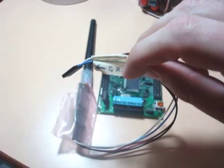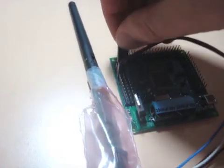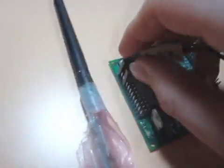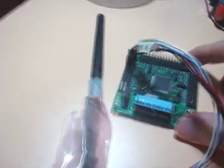Now there's also transmit and receive. I've already labeled these wires, so I'm going to plug them into UART0 right here. So now Bluetooth is connected to the Axon microcontroller.